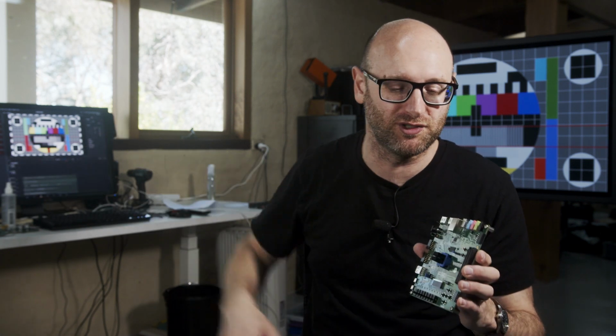It has more logic cells than what we need for sort of this project, but the reason why we like it is it has 16 channels of high speed, like I think around 5 gigabits per second LVDS, which lets you do theoretically 4 channels of 4K HDMI video, and you can do some cool things with that. You can imagine something built around this FPGA architecture would be a really interesting way to take sort of HD 12-bit video, bring it out to the analog domain, do cool stuff with it, and then bring it back into sort of Pro Tools like Resolve and really make use of the high bit depth and high quality that you can get from a device like this.